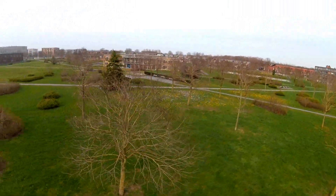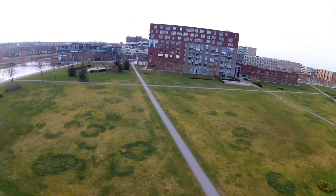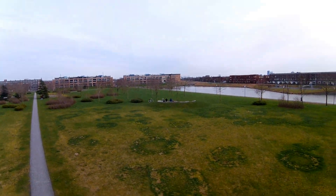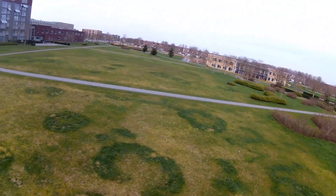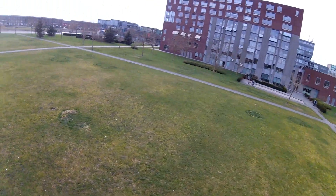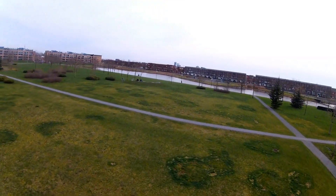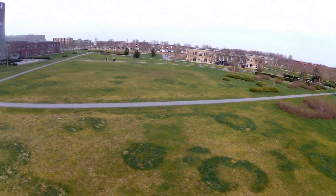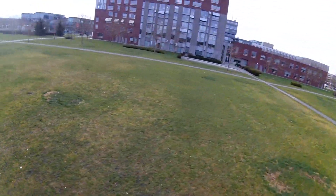However, there is something wrong with this footage. Since the last time I tuned this quadcopter, I have changed out the propellers and I've now added the weight and imbalance of that RunCam camera. So it is a little out of tune, as you can see — especially on the stands there are some prop wash oscillations. So I will have to retune this quadcopter for the propellers I'm now using and for the additional weight of this camera. I can tune that out no problem, and that might actually be a good chance to install a newer firmware as well.